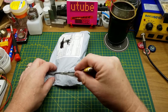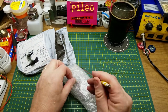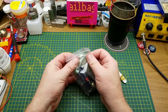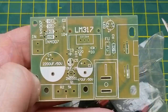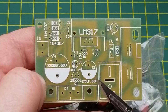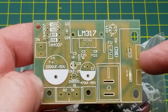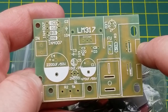First thing in, we have an expansion board module. Cutting gingerly with the old scalpel — more surgery. A kit! I think I recognize this one. It's pretty obvious what it is. LM317 — that is an adjustable regulator — and there are four diodes and a couple of big capacitors. This is a power supply kit. I think this is the power supply kit that a few other YouTubers have challenged each other, and ultimately me, to a speed build competition.